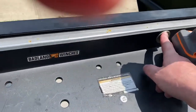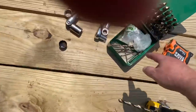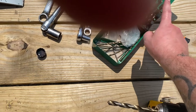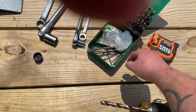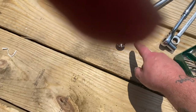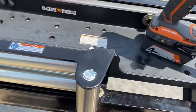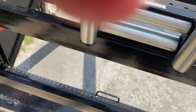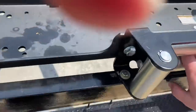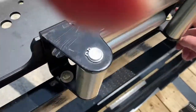We had the drill here, and when you start drilling you want to go smallest to the largest bit — it helps with the bits and saves their life. I got some oil here that I dipped into every time to make sure it didn't overheat. Once you get it all measured out and centered, you can bolt it up. Then, once this is installed, I lined it up and did my markings on both sides.